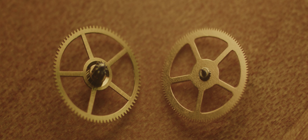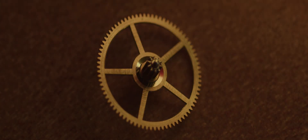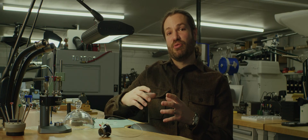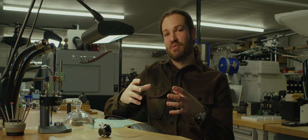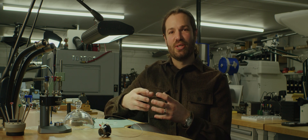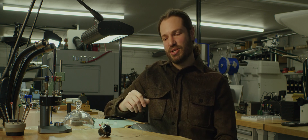The Geneva seal should also make the part last longer, and it can only be obtained if the finishing is done in Geneva. The wheel portion of a Geneva seal watch will be plated in gold, and there will be a polished sink around where the pinion rests in the wheel. This creates a really beautiful mirror image reflecting the highly polished leaves of the pinion above this sink, making the wheel appear more complex because there are more polished facets and reflections appearing in the center of the wheel.